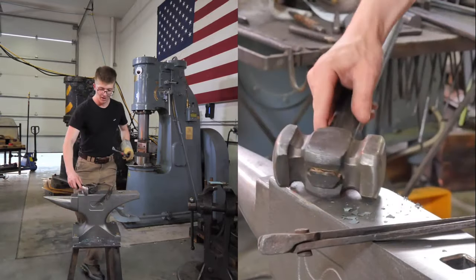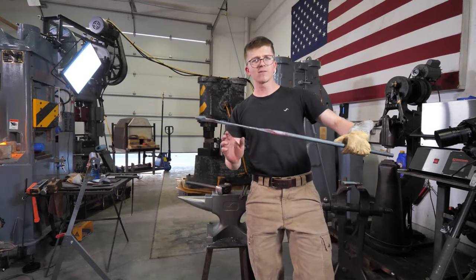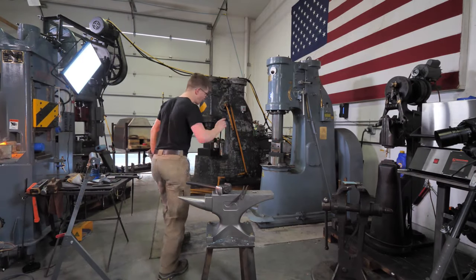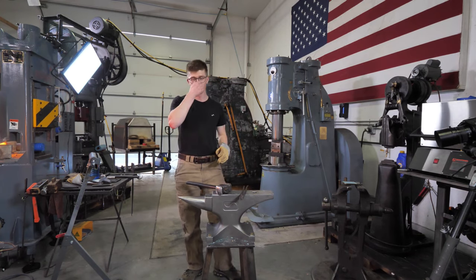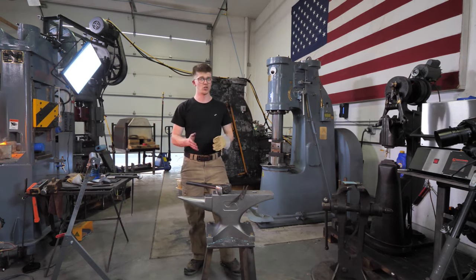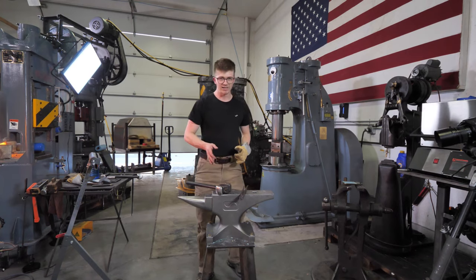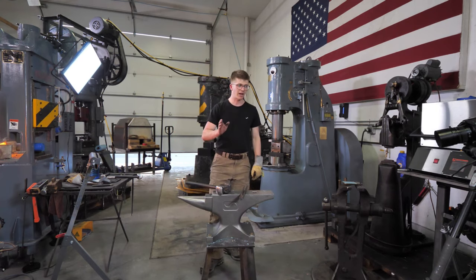Okie dokie. See that? I caught it. Kind of almost there. We're two-thirds of the way to half of a pair of tongs. That doesn't mean that we're halfway there to the pair of tongs. No, I'm going to be keeping you for much longer. It's been a long while since I made a pair of tongs. It's probably going to take a little while. Because what we have to do is draw out the reins enough that we have one half of a pair of tongs, draw out the reins enough for another half a pair of tongs, cut them in half, punch some holes, rivet them together, and it all starts to get really complicated towards the end. And so, what I thought might be a nice relaxing evening is probably gonna be a little bit more involved. It's okay, this is good fun.